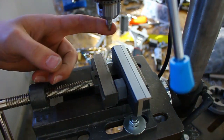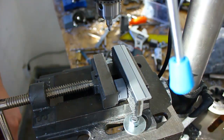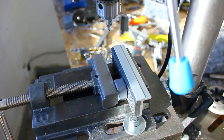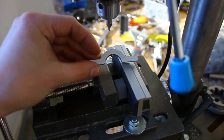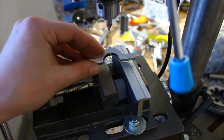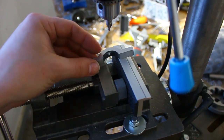The diameter which it leaves is 3.5 millimeters. Now the tool which I showed you just a second ago — the pin that I machined down in the lathe slightly is about 3.4 millimeters. This gives a little bit of clearance if the hole isn't lined up perfectly or such.